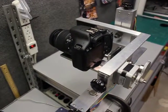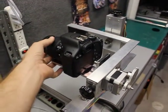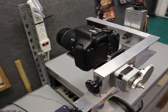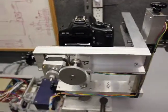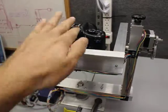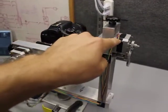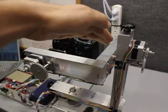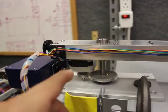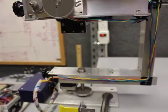This head was all made specifically for the Canon T2i, which is our new camera that's going to be utilized in the film, so it's all balanced specifically for that camera. You can see there are three separate motors that control the three different axes. This is your roll axis — as this turns you actually see the camera turn. Moving back a spot, you see the tilt motor right there which tilts it up and down, and then hidden underneath there is the pan motor, which is actually moving the entire arm around back and forth.